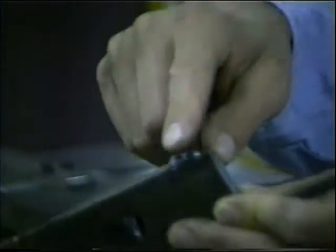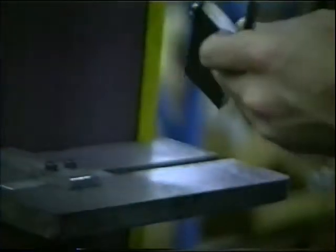Once the first vertical cut is done, the weld tabs can be removed since they will not be used in this position again. Since the weld tabs can be used any number of times, it is important to remove old weld material so they will lay flat the next time they are used.